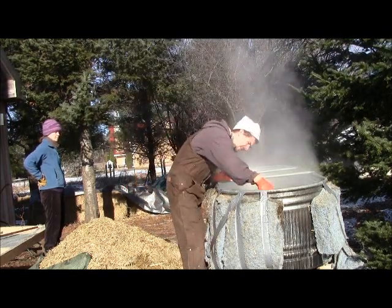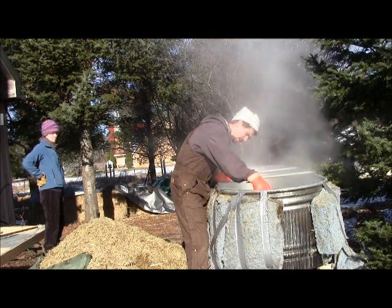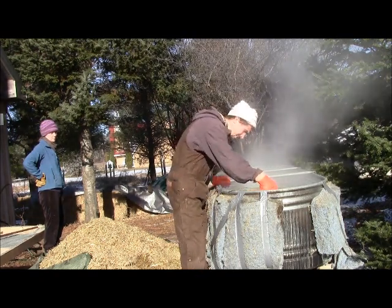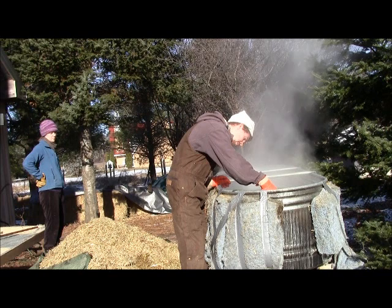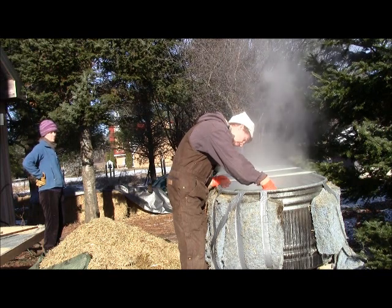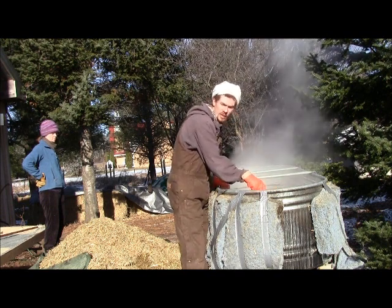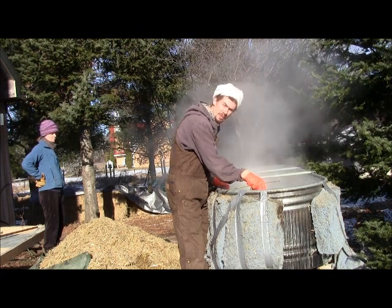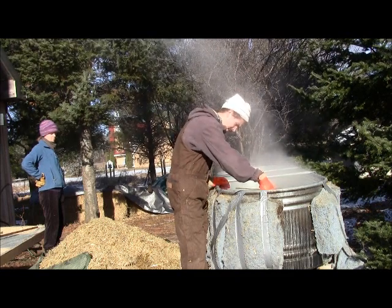At this point I'm not as worried about heat loss since we're getting the water hot enough to deal with any thermal loss coming out on demand. Hopefully you can still see me through this vapor cloud — but we're still doing good. Coming out of the tap we were measuring about 172°F, and after about an hour of filling, we're still at about 160°F in the tank. Once we get the straw in there it'll probably drop to 150°F, which gives us a good 19 degrees of buffer above that 131°F minimum we don't want to go below.